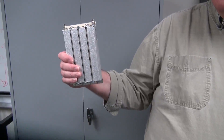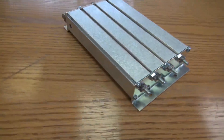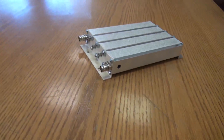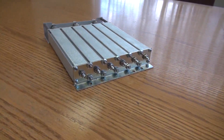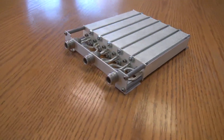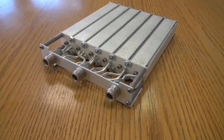Hello, my name is Mike Mackey. I'm an engineer here with Sinclair Technologies, and today we're going to be tuning some of our smaller filters. Specifically, we're going to tune the FP30401 and the MR356. The FP30401 is a small pre-selector that we use in our receiver multi-couplers, and the MR is a duplexer used for mobile applications such as cars, sometimes in trains, but any sort of mobile application.